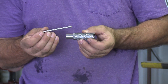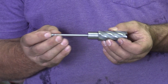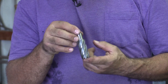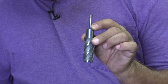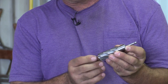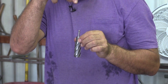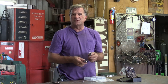Another cool thing about the annular cutters is this little shaft — what does this thing do? Well, it goes inside the cutter, and when you're cutting through metal, this thing is actually being pushed up inside the cutter head itself, all the way up inside, depending on how thick a piece of metal you're cutting. This is the plug that came out of the piece of half-inch plate that I drilled. When you finish drilling and retract the cutter up out of the metal, there's actually a plunger up inside the drill.